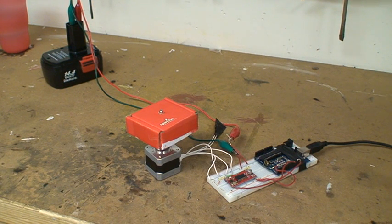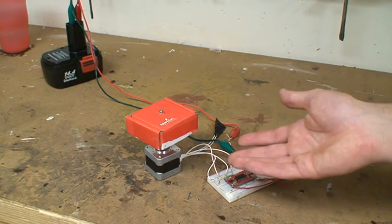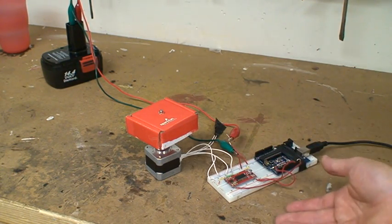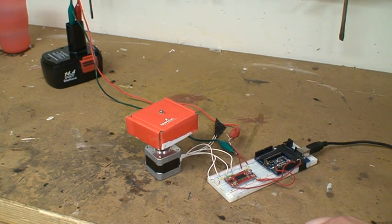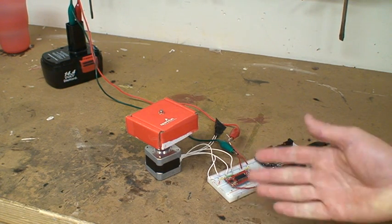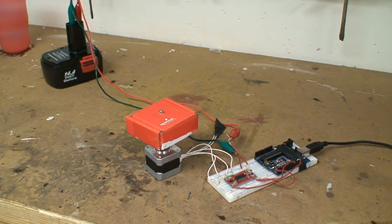Which is very good, because when you can cut off current to the motor, you can have it sit there but not waste electricity. Right now, it's probably drawing 750 milliamps just to keep that motor staying where it is, but it's not under any stress. So if I just turned off the current, it could sit there, and then I could juice it up when I want to move it. But version 3 doesn't allow that, so I'm just waiting for version 4.